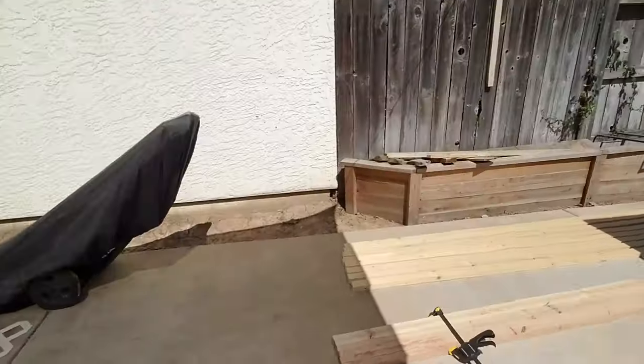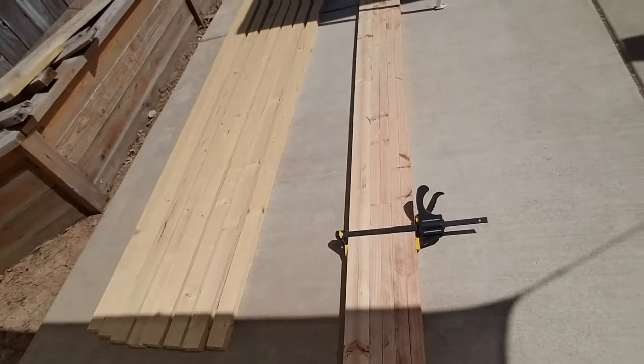Hey, what's up guys? In this video I'm gonna be making a garden wall. They usually come like four panels that fold together, but mine's just gonna be three. I did start a little bit already — mainly wood prep. As you can see here, this is what I'm gonna be using: these were three two-by-fours that I ripped in half, so there's six pieces here.